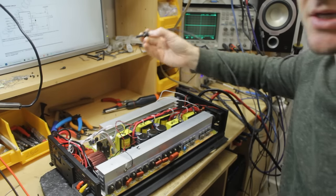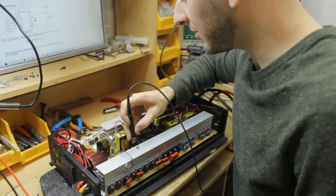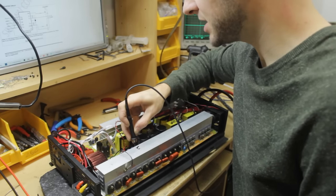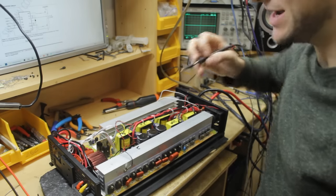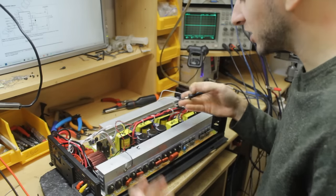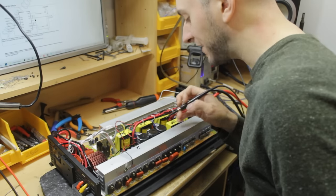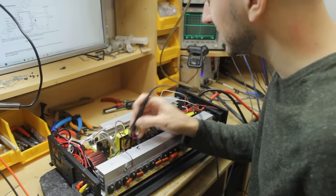Nothing there. There's also a shunt resistor, just a couple of folded bars here on the main board, and that will most likely be dropping a touch of voltage across the high voltage rail itself to then determine how much current's being drawn from the rail, and there's no high voltage on there, so I think we're pretty safe that these high voltage caps have been self-discharged.